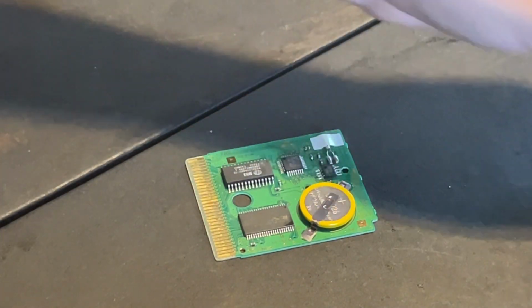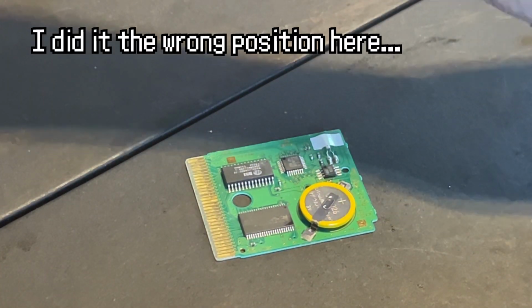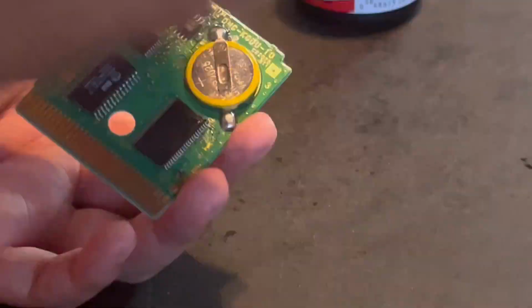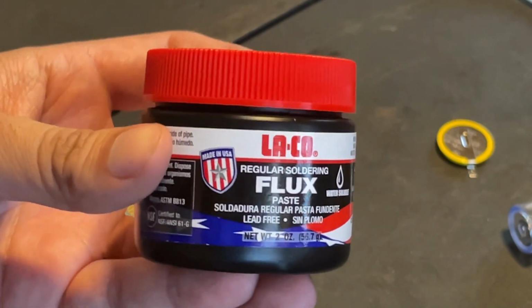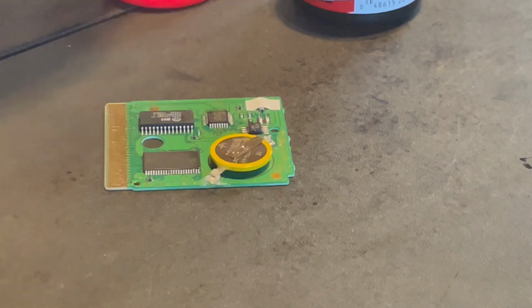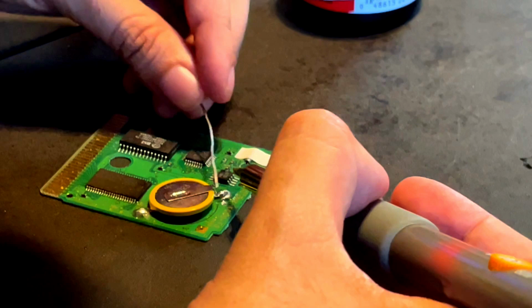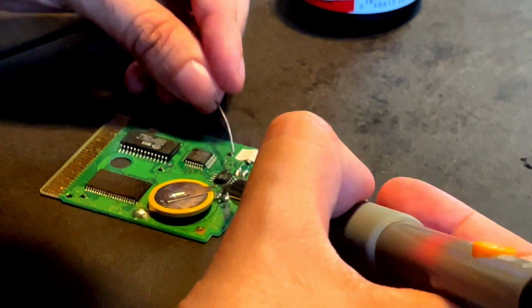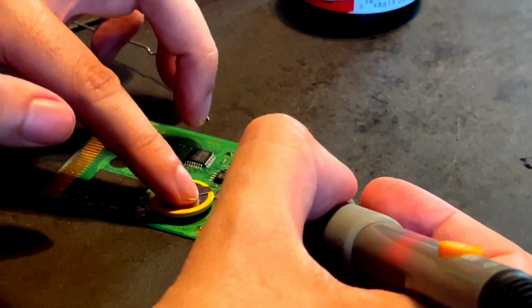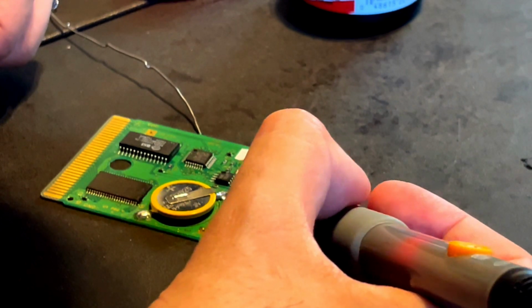Also make sure the battery's positive and negative position is actually in the correct matching position, that the metal feet on both ends are aligned with where you need to apply the solder metal. Then apply some flux once again on the ends where you will melt the solder to make the process more effective. Once that's done, carefully aim the metal stick to the first end of the save battery with the soldering iron. Melt the metal piece to apply it on the positive and negative ends so they stick in place once it becomes solid.